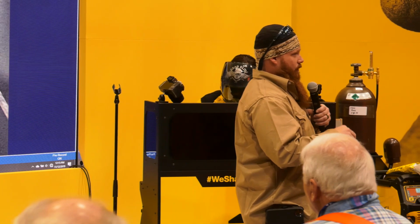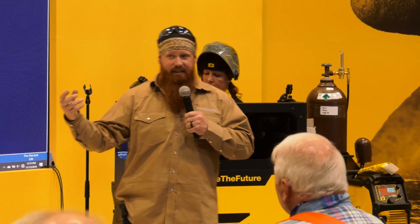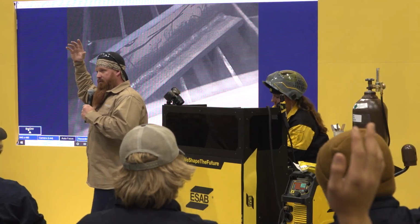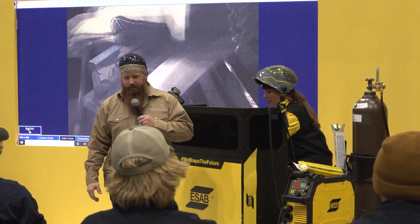Your F1 classifications are typically your fast fill. So like 7024s, 7028s. 7028s also going to fall into a low hydrogen, just because the iron powder that's in the flux kind of helps for bead appearance and deposition rates. But anybody ever run 7024? Okay, you're putting down some serious metal in the flat position, filling thick material up rather quick.